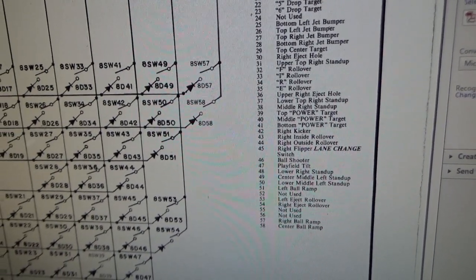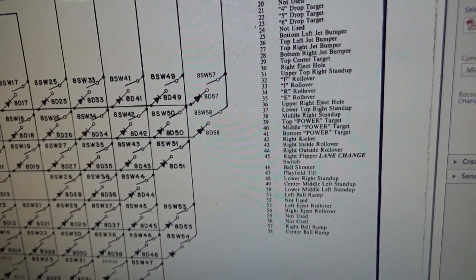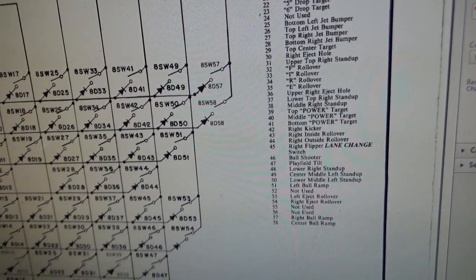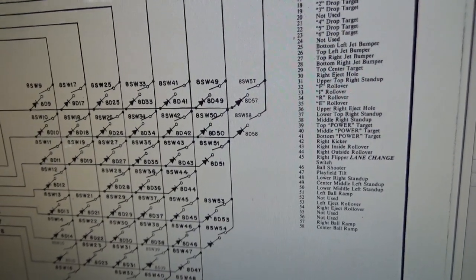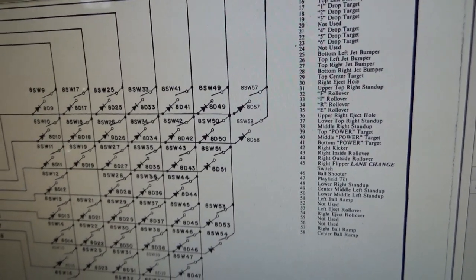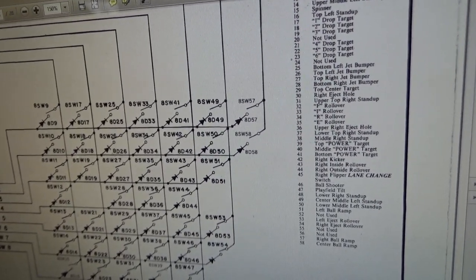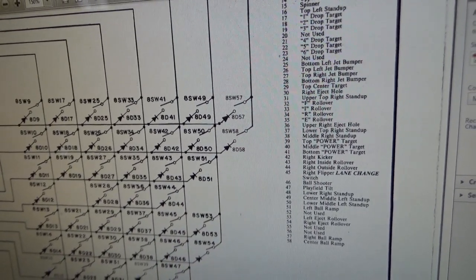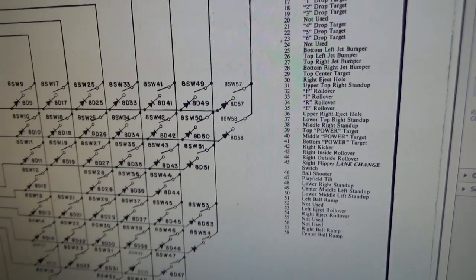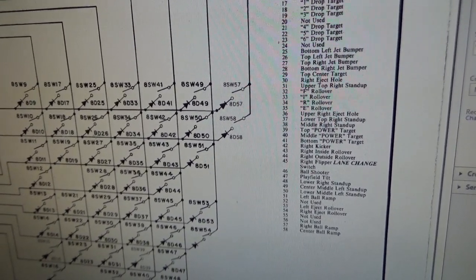Remember I was saying they don't have ball ramps. It's the multi-ball ramp. This was the first solid state multi-ball game, so they hadn't standardized all of their phrasing yet, and nothing had ramps on it yet. So something this old, the ball ramp is down where the balls are. So those two are locked on at the beginning. They're supposed to be. So that's good. So I'm going to take them off our list of problem childs.